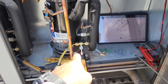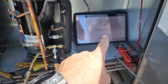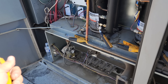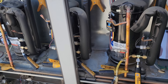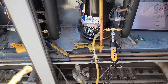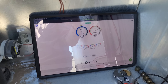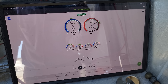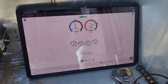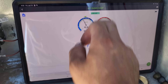An odd thing happened — when I put my charging hose on the JobLink probe, I always purge from the system out and connect while it's under pressure so we don't get air in the system. There was nothing there — I found the probe wasn't depressing the Schrader. Once I got it to depress the Schrader, the pressures are a lot better but still kind of low. We're running a 32-degree saturation temp — that seems a bit odd. Superheat's not 67 degrees anymore.